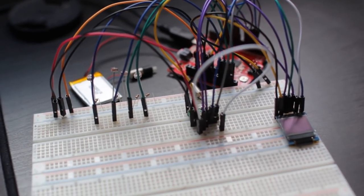Now that I have all the jumpers connected to the Arduino and the components, I just need to write a quick Arduino program and test out everything to make sure it all works. Writing programs like this can be really helpful for later on. You can define all your pinouts and test them, and save those for when you're designing the program later — you can just copy and paste them over. It's especially helpful if you're working with motors, because sometimes microcontrollers can have pins that behave weirdly in certain situations, like when you plug it in. You don't want the motors to spin when you first plug it in — you only want them to react when the program tells them to.